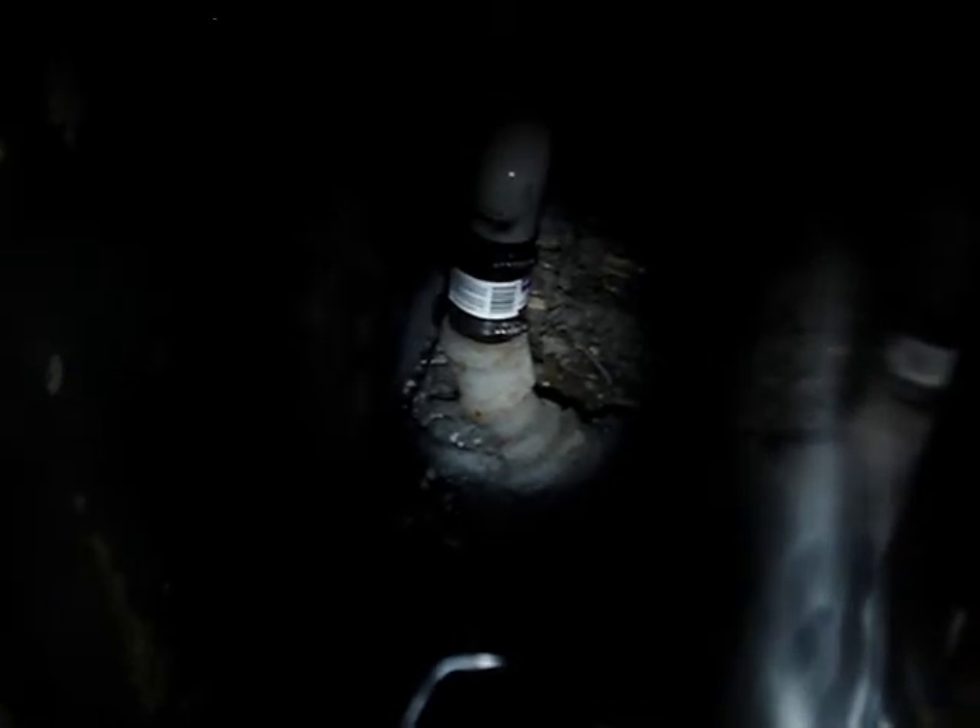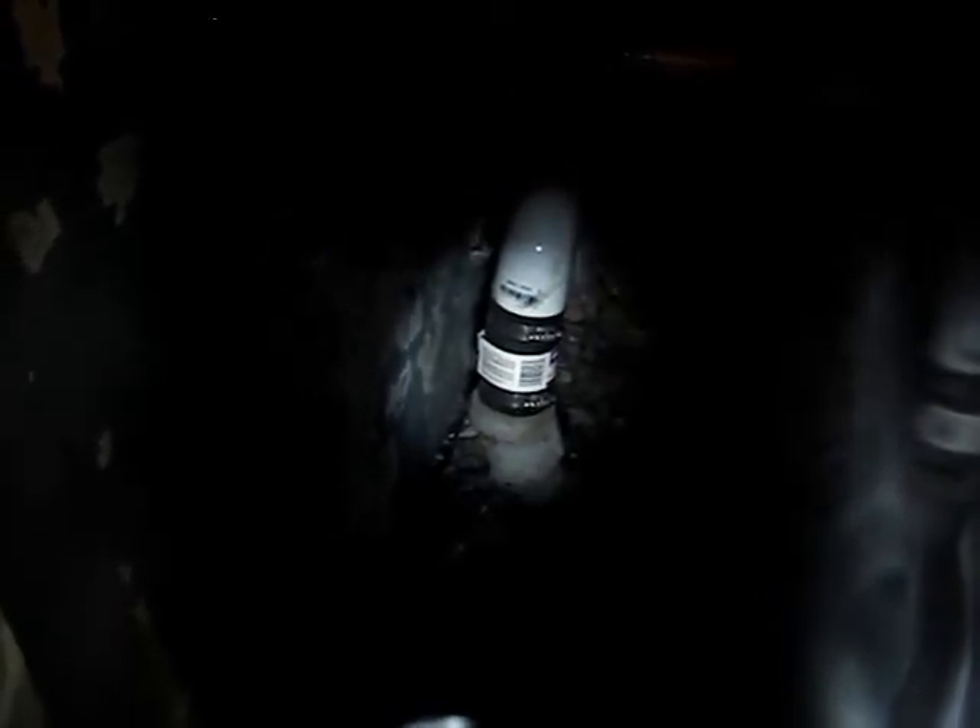That's where the drain starts, and that's where the trap connects to. The piping runs all the way along this basement wall here into an elbow, then across again into a T with a cap on it, then it goes across into another elbow. Then the pipe runs along this wall into the floor drain. The floor drain is steel and I had to cut it to size with a reciprocating saw. I joined the PVC and the steel together with that black rubber boot — it's just like a small radiator bypass hose, with a couple of radiator hose clamps on it, so that way it joins the PVC and the steel together right there.